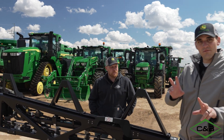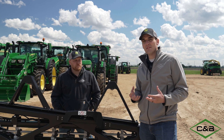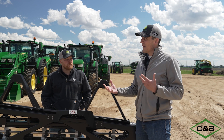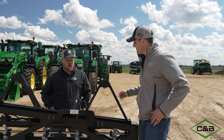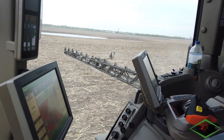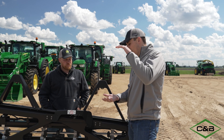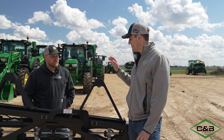There are two valve blocks now for controlling boom height as we're going through the field with the Boom Track Ultimate system. There's a smaller valve block that's going to do about 90% of the minute adjustments as you're going through the field, and then there's that larger valve block still to be able to move that boom up and out of the way — if you go into a washout, need to raise the boom up really fast, or you're folding. So we're gaining a little more minute functionality there, just keeping that boom very stable. This is critical, as we talk about accuracy and being able to utilize the spot spray — we've got to maintain a very specific height for the cameras and the nozzles to work properly. With the Boom Track Ultimate, you're going to be within a 10-inch window 90% of the time, so you'll be at the right height when your system needs to spray the weeds.